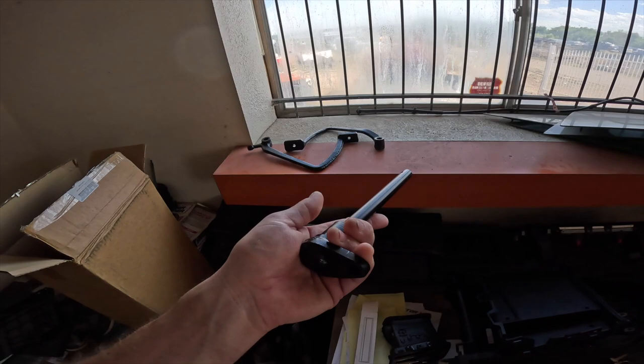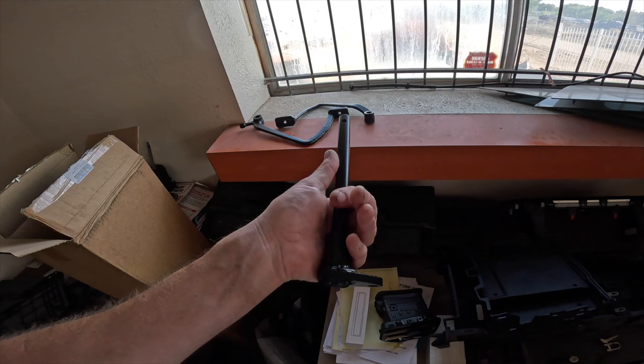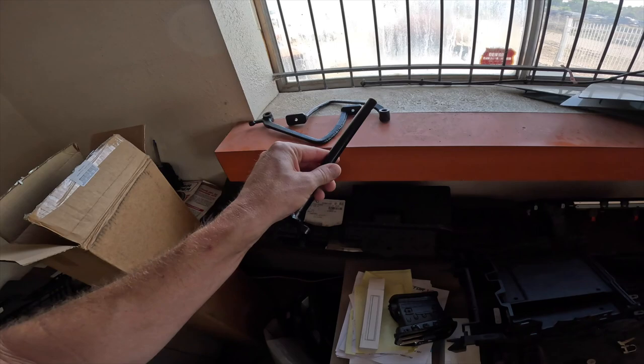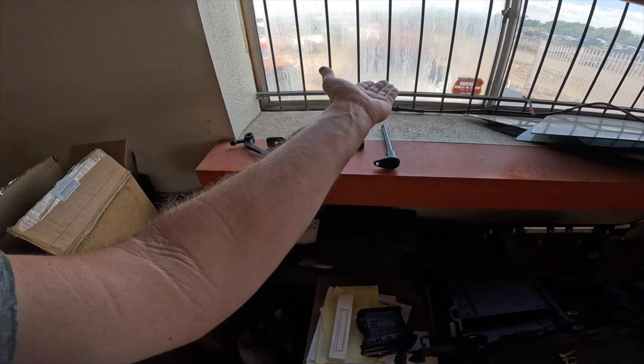So this is E100 Blackout. This stuff is meant to be on sliding surfaces, and it's a really thin coating. So it's not like powder coat. It's not going to chip. It's not going to peel. It's not going to flake if you prep the surface properly. It's meant to be on this like this. And it's really nice because it's chemical resistant. It's not going to have any issues ever rusting again. And it's probably going to look like this for probably 100 years.